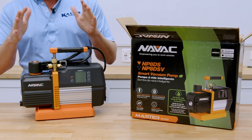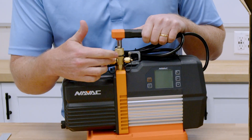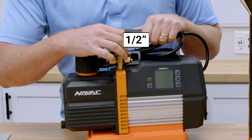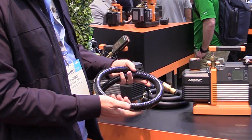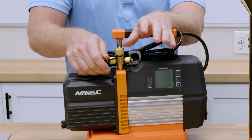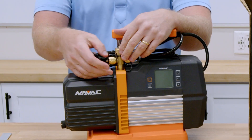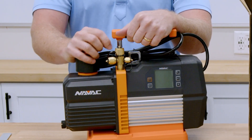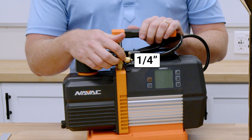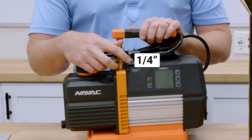All the quality NAVAC vacuum pumps come with multiple ports. You have the half-inch port here on top, which is going to go to your big boy vacuum hose — my current favorite vacuum hose on the market. Then you have your three-eighths connection here on the side. If you're evacuating a system with two hoses and don't want to use a manifold at all, you could use one three-eighths hose here and one half-inch, or you could use a Y adapter, which NAVAC also makes. Then you have your normal quarter-inch port — usually just used as a test port. We really don't recommend using this for vacuum to actually pull on the system.